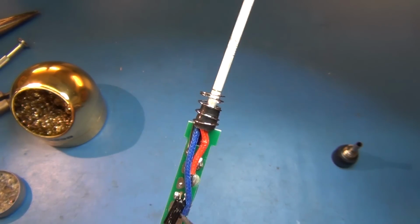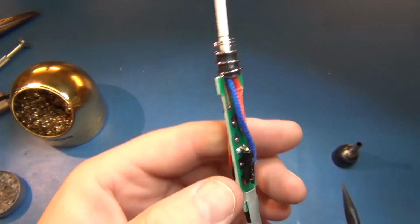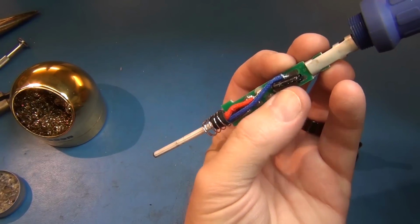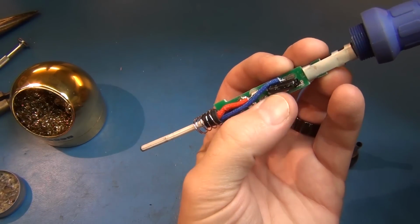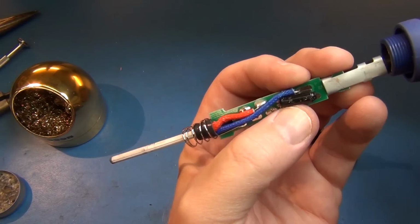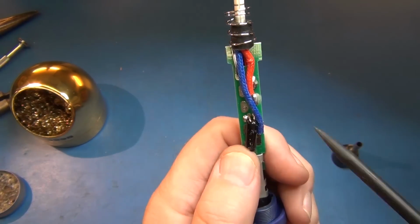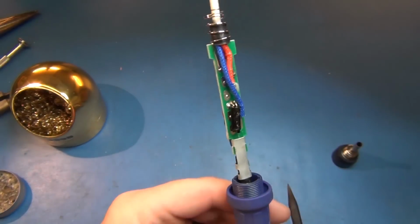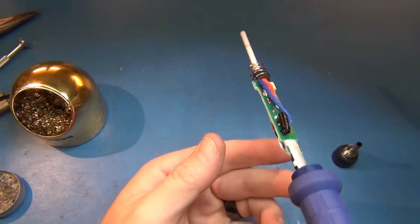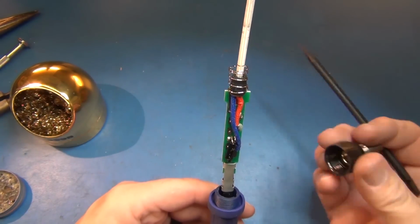In this case, there's one extra wire for this, which is the ball switch. And there's actually a little ball bearing in there. And when you tip it, a little ball bearing will fall down from this chamber in this black sheath, which looks like some heat shrink wrapping on that to insulate it. And that makes contact between the feed wire and that wire, and then of course the electronics can sense that this has reached at least enough of an angle to where that ball bearing can roll forward, and that's what wakes it up from sleep mode. So quality's fine, nothing wrong with that so far.